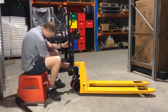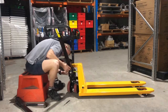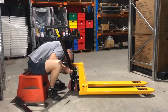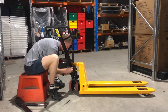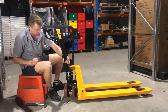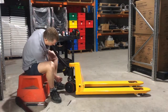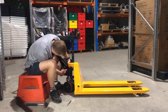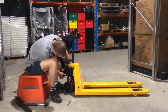Grab the chain — now this is a tricky bit. You have to line the handle pivot pin up with the chain so it drops through it. It's easy to feed it in over the top, but you've got to feed it back through the centre of that pin. You know when you've done it right. Now you've got that back through this side here. Then you've just got to feed the bottom up through this section here, so let's get that chain in over the other side.